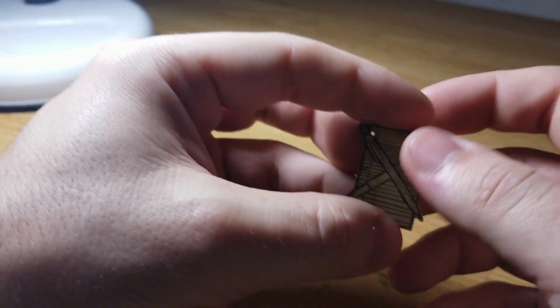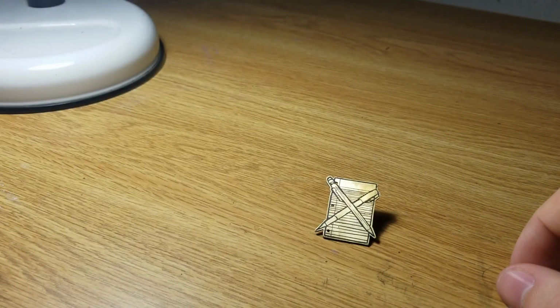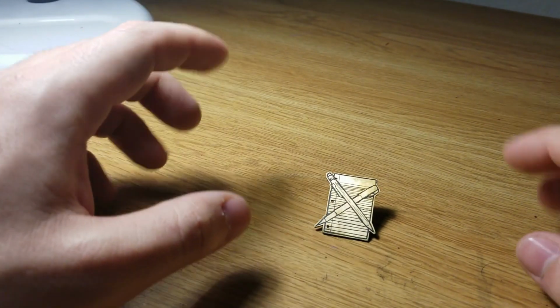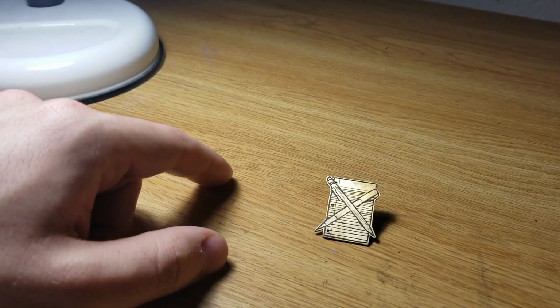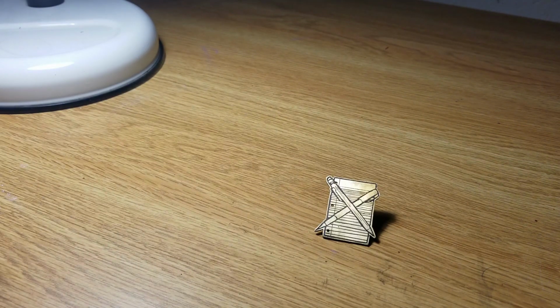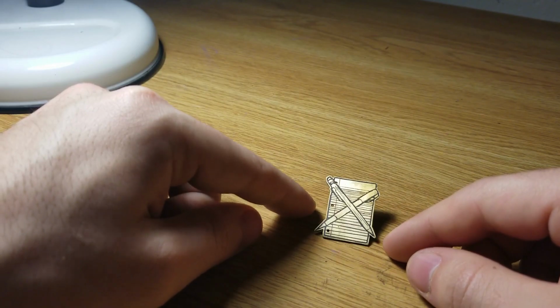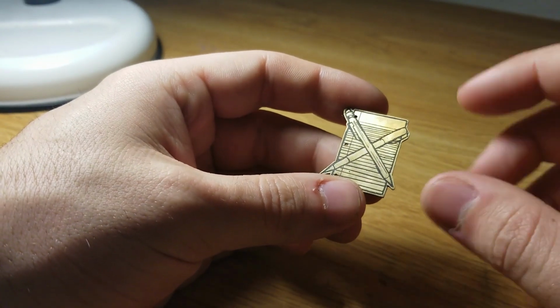After that, we learned how to etch. So etching is where you use an acid to eat the metal away. What we did with something like this is you take a piece of brass, you spray it with black spray paint, do two coats to cover the side completely. Then you take a sharp tool like a knife, or in some cases the tip of a pencil, and you just carve away at the paint until the metal is showing. You have to think in negative, so that the black is what will end up being the lighter color, and the metal color will end up being what's receded. In my case, I did make them black by rubbing a black finish into the crevices.